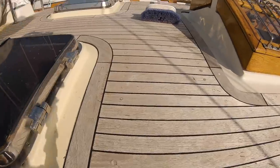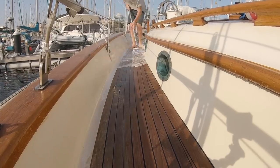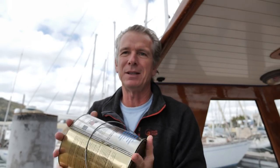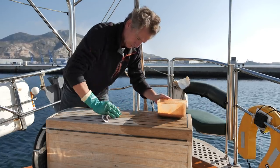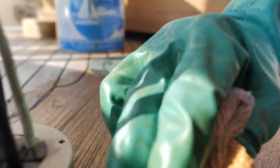Things have been pretty good. There are a few little mold spots which clean off easily, and I've got some wear marks on things like the pin rail — that's my fault, I put two coats on instead of one. The test to see if it needs redoing is to drip some water on and see if it beads up. This isn't beading up — it's soaking in — so it's time for another coat. First, a good wash with a little bit of washing-up liquid. Let it dry and then put another coat on. The color I like most is natural. Main thing to know with Semco is it needs a good mix-up before use as the sediment goes to the bottom — stir it as you go.